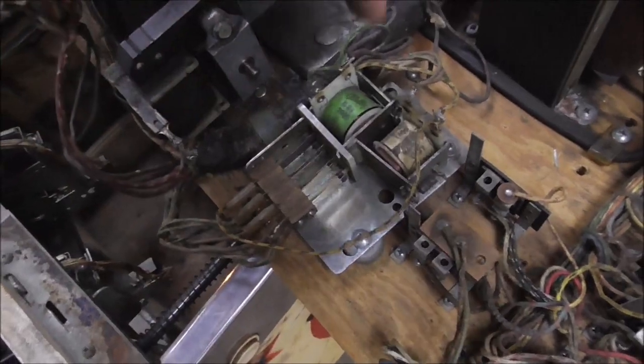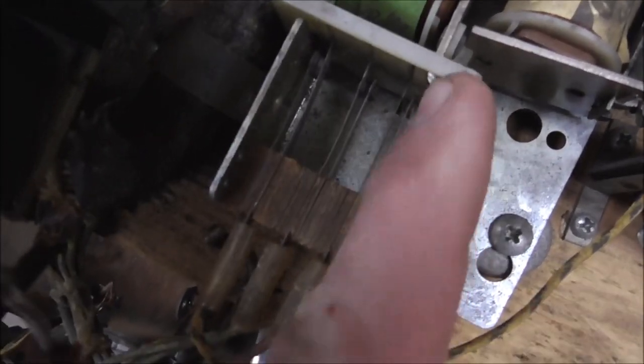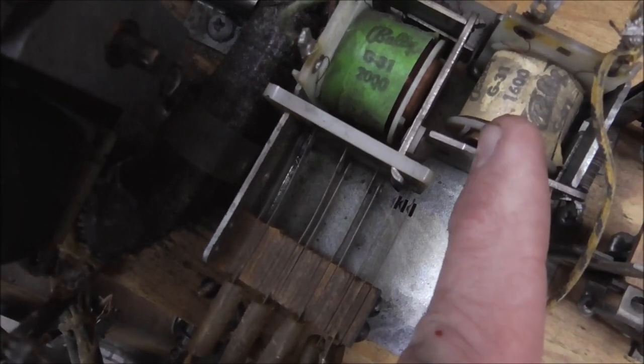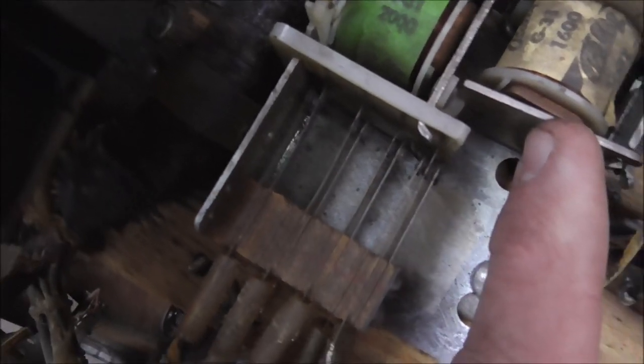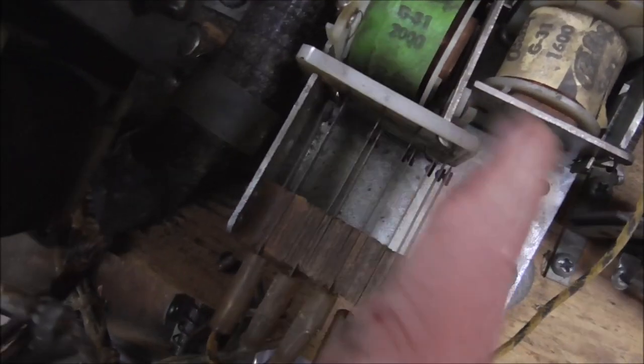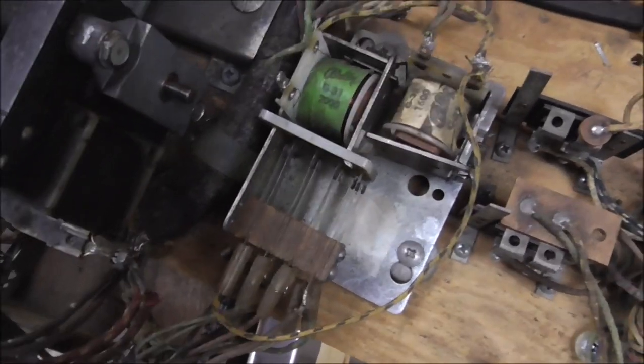This one's interesting — when it pulls in, see how this switch is connected one way and this one's not connected? And then this is the trip relay: when it pulls in, they are now connected the other way. So it's a latch and trip relay.